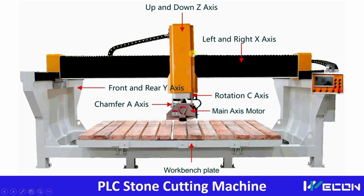Now this is common in every machine. But what is new in this machine? That is the A axis and the C axis. Here there is one main motor which only rotates the grinding wheel, or we can say cutting wheel, but the A axis can rotate this complete assembly through 360 degrees. There is the C axis also. Previously we saw that right now this plate is vertical, completely 90 degrees to this board, but due to the C axis we can make this wheel slanting. So we can cut slanting angles also.